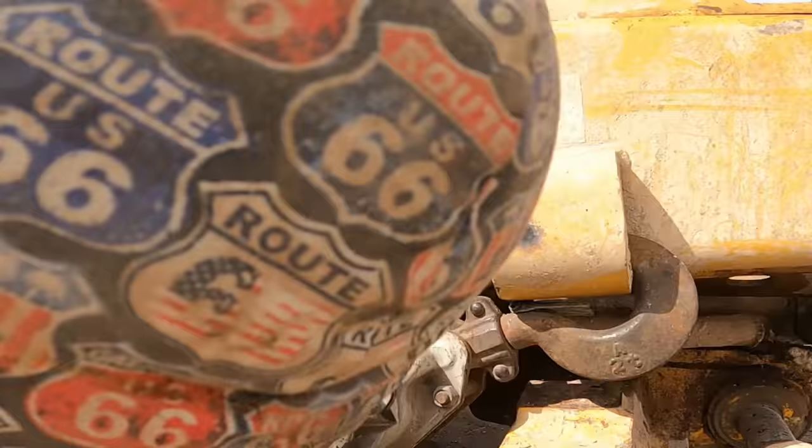All right. Well, you see, that wasn't so bad. Now, there are some areas that got more gaps than others, but that's okay, right? More for the weld to penetrate. But actually, what I'm gonna do now is gouge those areas with the actual arc gouger and just be mindful of the spots that are a little wide.